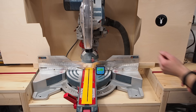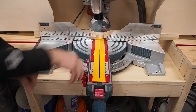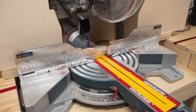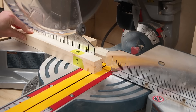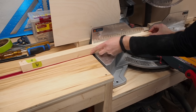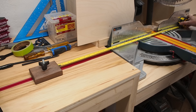I'll start with the four legs. The bottom and top of the legs need to have a parallel compound angle. I started by beveling my miter saw by 5 degrees using a digital gauge to dial it in, then swung the blade to the right by 5 degrees as well. With these settings locked in, I trimmed off one end of all four legs. I've labeled all the legs to avoid mistakes — initially the A is on top and the B is on the front. When you flip the board to trim the other end, you should see the A on the front and the B on the top. I set a stop block for consistency and cut all the legs to length.